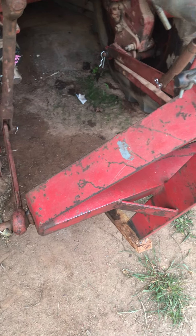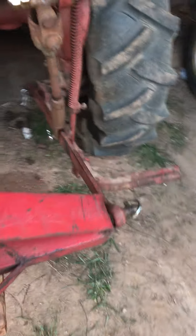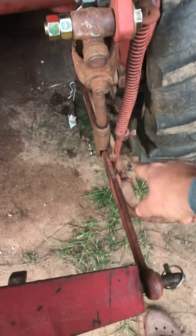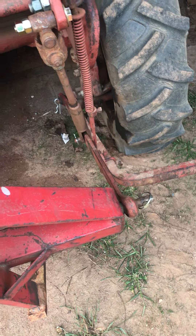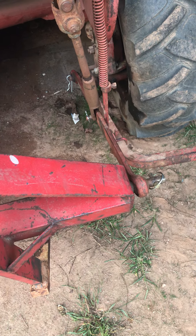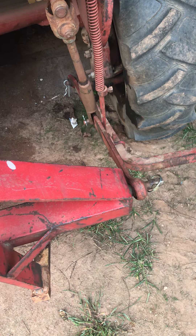This is James back with more farmalls. I'll show you some minor rework on my three-point hitch. If you look back at my other three-point hitch videos, I just had a chain with a D-hook going down here, two little metal brackets with a little chain on it from both sides. That's how I brought the tractor — had it about a month now. Those chains worked fine as long as you were pulling something that just rolled along behind you, like a bush hog.